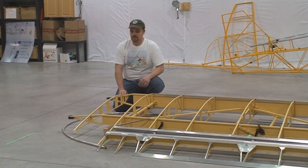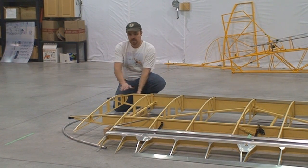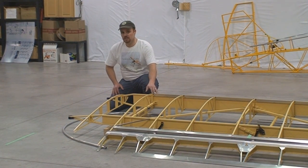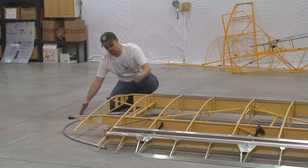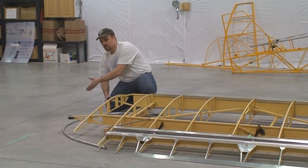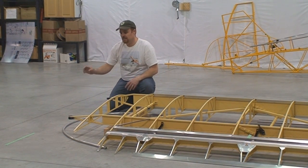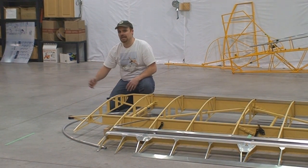The bow tip is somewhat of an inefficient design because as the wing tapers down, all that air just spills off the end. Our squared off extended wing comes out here, so we get this full airfoil rib profile coming out all the way to the tip, and then we have a composite tip that goes on the end. We now have a new efficient Hoerner style, it's got an upswept design, and it's not designed for low end characteristics, it's actually designed for minimal drag at high speed. So we designed it for minimal drag at 100 miles an hour.